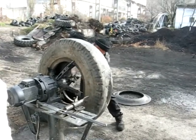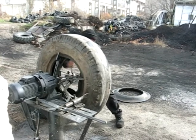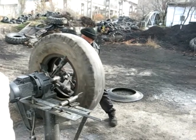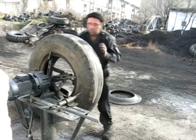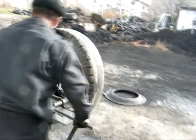When the tires are recycled, we recommend using the cutting machine to increase the density of loading inside the retort. The diameter of the retort is 1.15 m, which is enough to place even truck tires there without preliminary cutting. The side parts of the tires are cut off from two sides and put into one tire.